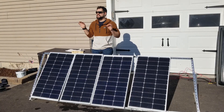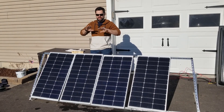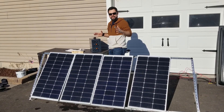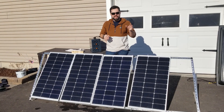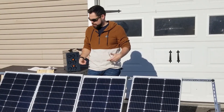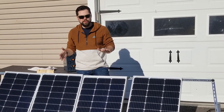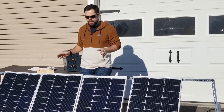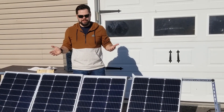We have a perfectly clear sunny day. It's the middle of winter so the panels are nice and cool, no clouds, no shading from trees — these are ideal conditions. Each one of these panels is performing at about 85 watts right now, which makes sense because the sun's a little lower in the sky. The charge parameter is 14 volts to 90 volts and up to 30 amps. You can connect four panels in parallel, or better in my opinion is series — one panel connected to the other.